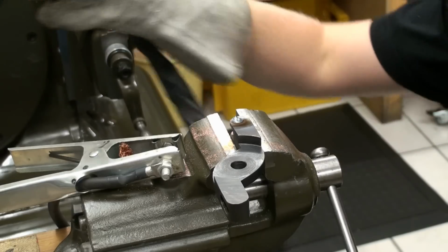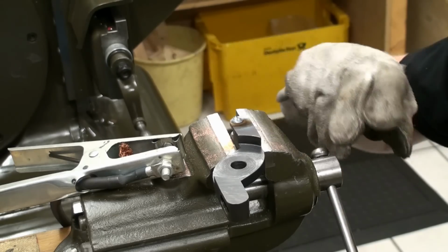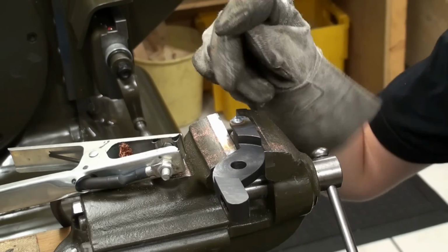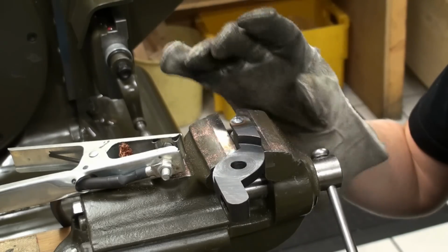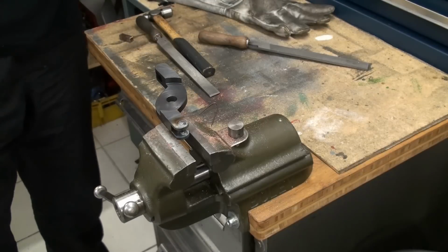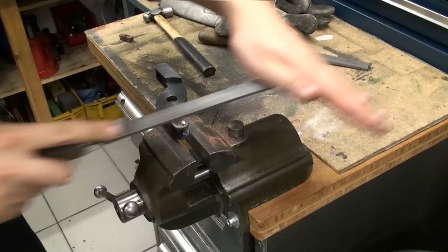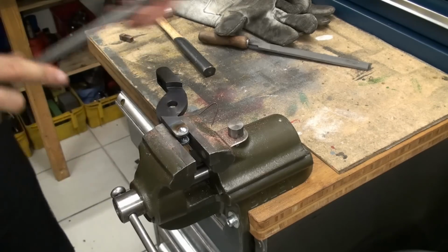But we will see when we machine it what happens. On one side there will be a plate soldered in anyway, so that's some additional support. And the pin will be stationary in these arms, or in the bores. The knurling wheel will turn on it, so it's not super critical. I hope this works out. Okay. I'm going to hand file these welds, and I will need to machine them in the milling machine. That's still warm.